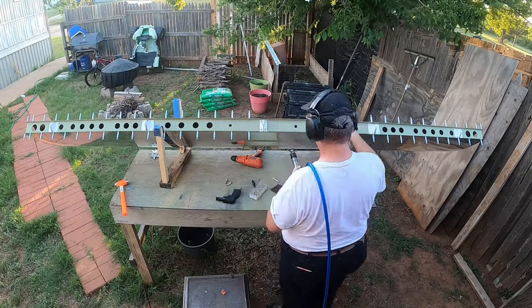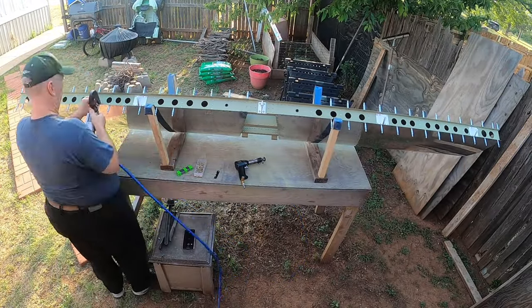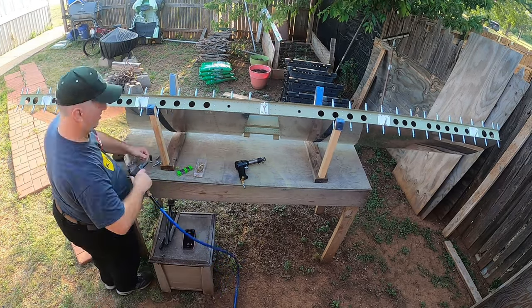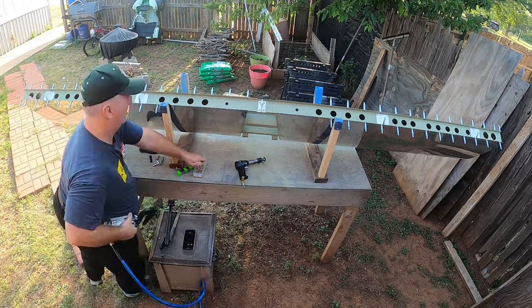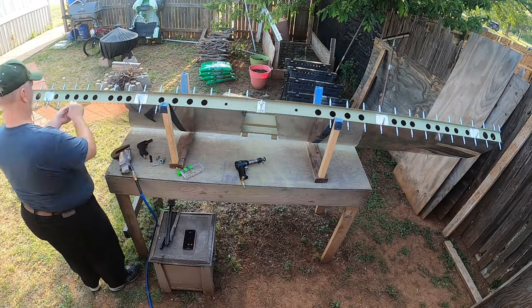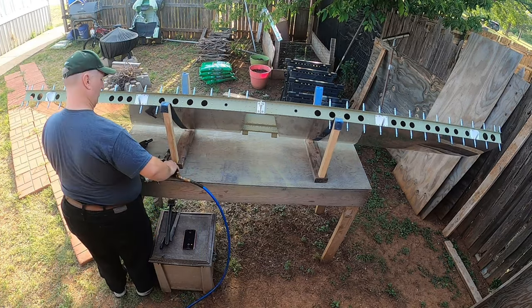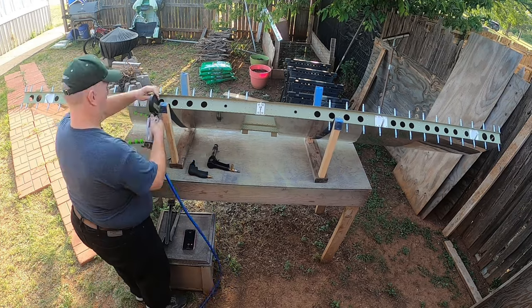So what I ended up doing was using the squeezer for the rivets that were in between the brackets, but for around the brackets themselves, because the bolts were getting in the way, I went ahead and switched over to the footed bucking bar, the steel one. And that seemed to work pretty well, because